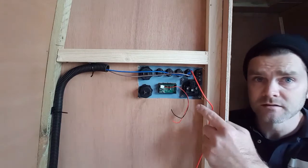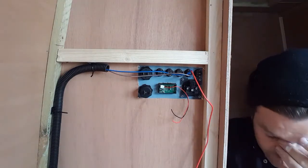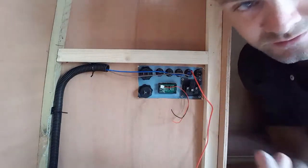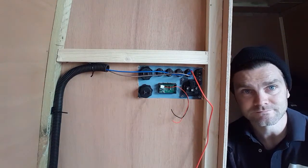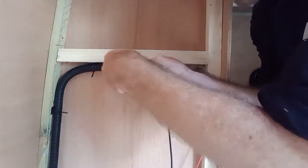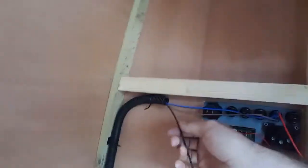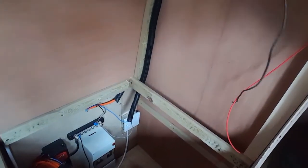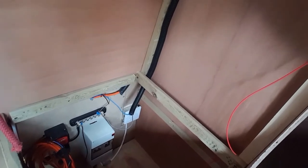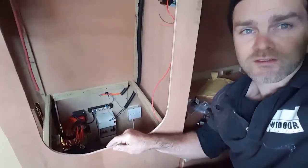I'm setting up this little switchboard and I'm using this conduit again - this stuff that I swore I would never use. I've just been getting stressed with it again, trying to push cable through it and it getting caught on all these ridges. I've just learned how to use these things though - rather than pushing it straight, you fold it, and then that cable goes all the way down to there. Simply push it - there we go. That's how simple it should be.